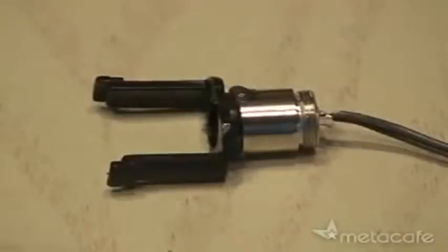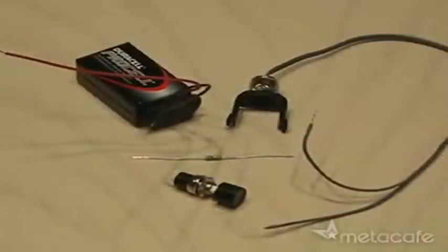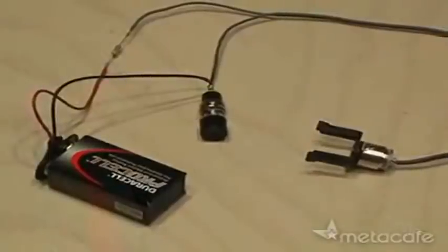I also picked up a 150 ohm resistor, a 9-volt battery, a 9-volt battery snap, and a new switch that'll replace the phaser trigger. After soldering the connections to the blu-ray diode, the 9-volt battery, the resistor, and the new switch, it was time to reassemble the phaser.